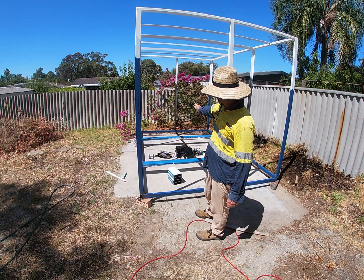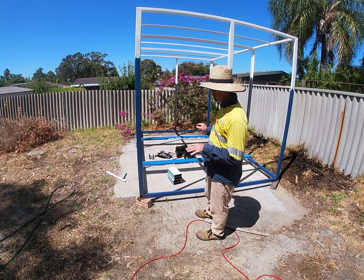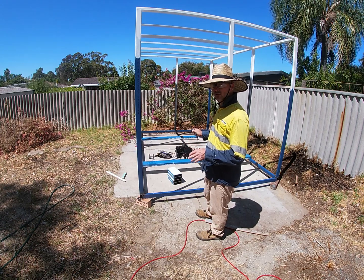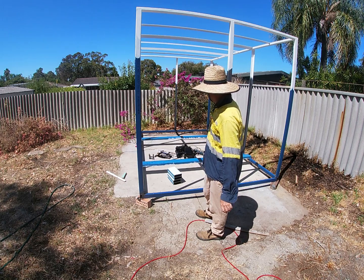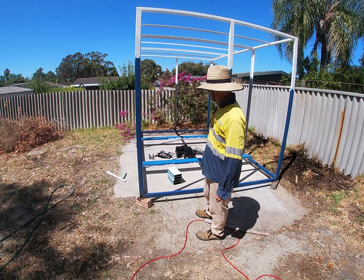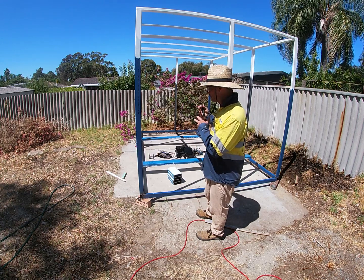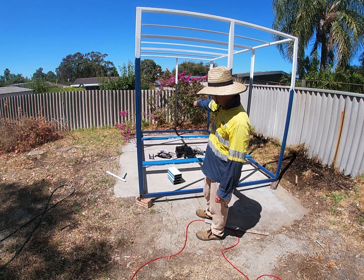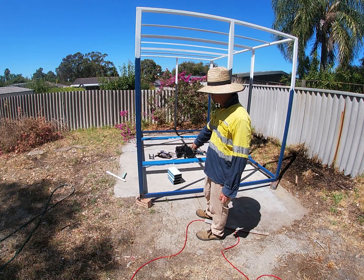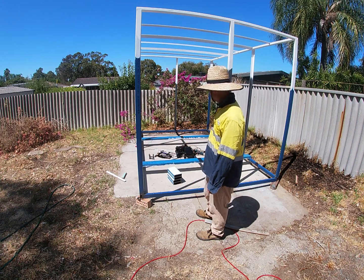So I'm putting in these 2 pockets underneath. So if this thing ever has to be lifted up with a forklift, hopefully the forklift will be able to put its forks in these pockets and just pick it up. I've already painted the underside of these pockets white because I'll never be able to get to the underside of them again. So the pockets, and then there's 4 300mm pieces for each corner, and that'll reinforce each corner.